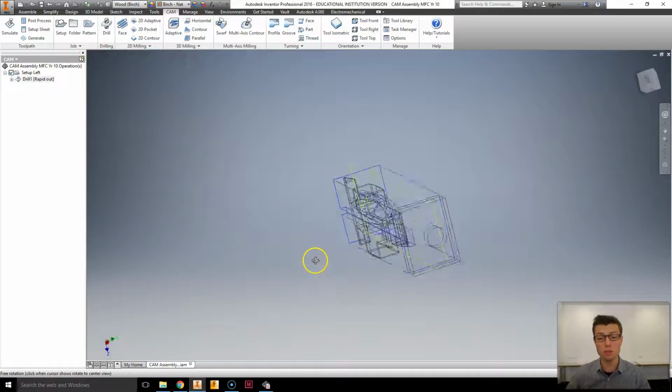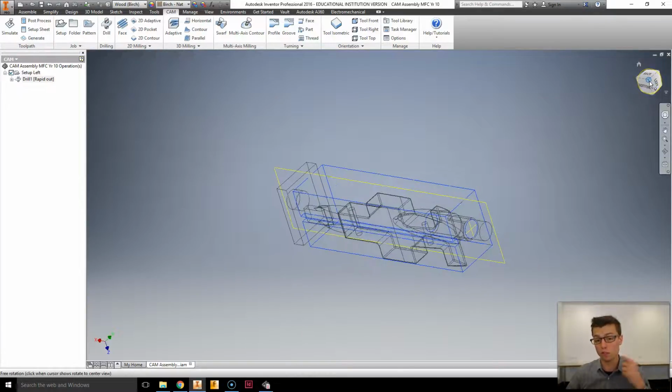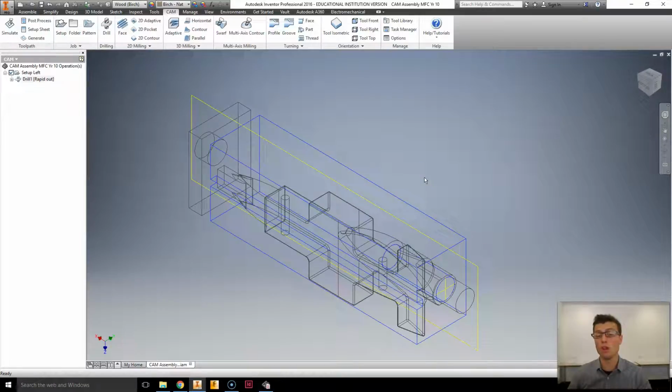Because of that, to reduce the wear and tear on our machine and also to investigate other programs, we should be running what we would call a roughing code. The roughing program is designed to remove a large amount of material accurately and not go too close to the material that you want to be there at the end, like the finished product. So it leaves a bit of excess that you've then got to remove with what we call a finishing program.